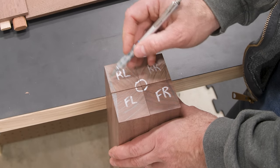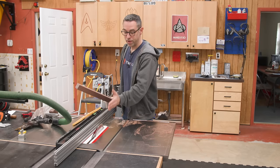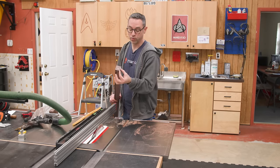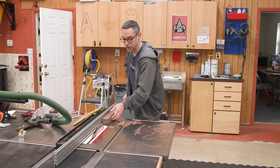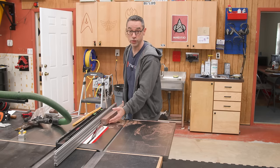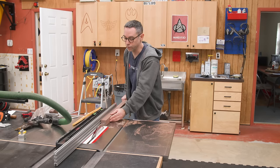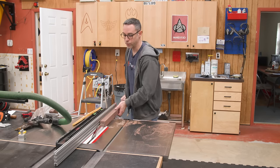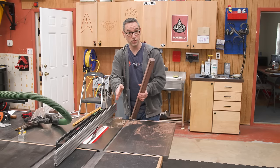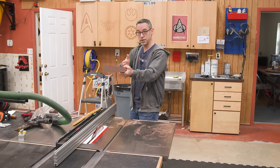I've already got these done, but we're going to go about a quarter inch in from that outside edge. I've got the table saw beveled at nine degrees and the fence set at an inch and a half, which puts me right about where I need to be. We're carefully making this cut. It's a good idea to have a riving knife — you really should in the first place, but this is definitely one of those cuts where things can drift if you're not careful. Each leg might need to be positioned differently because we can't change the tilt of the saw — it only goes one way, but you can usually reposition the legs to get the angle where you want it.